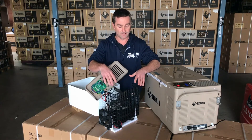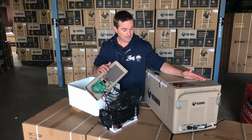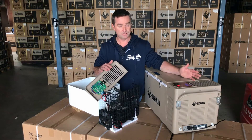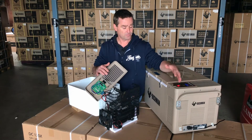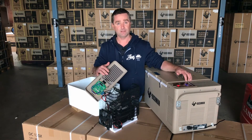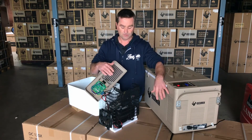Another critical thing with refrigeration is getting the heat out. In our cabinet we've got ventilation all the way around — top, bottom, and sides. You want to get the heat out, especially from the compressor and condenser which can get quite hot at 35 degrees. If you haven't got that ventilation, the heat goes into your cabinet, everything gets warm, amp draw goes up, and all sorts of problems follow. So ventilation is critical.